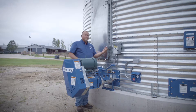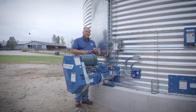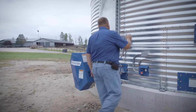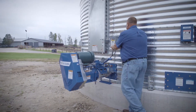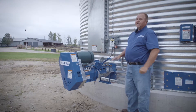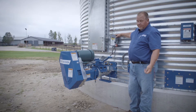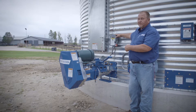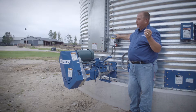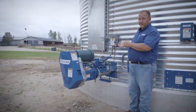The next step is lockout/tagout procedures. We come over to the main power box, disengage the power, and put the lock into the disconnect handle on the power box. That way nobody can access the power of the bin while the machine is being serviced. The only one who has the key is the man who put the lock on the outside box — he keeps that key in his pocket so nobody can turn the power on while he's in the bin doing service work.